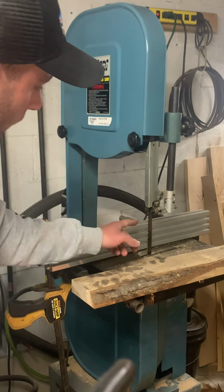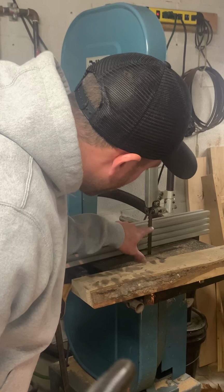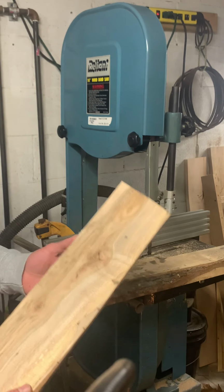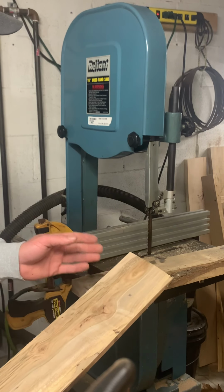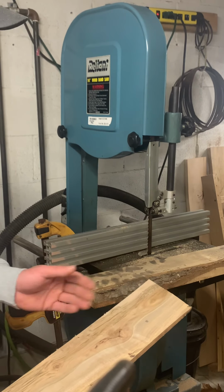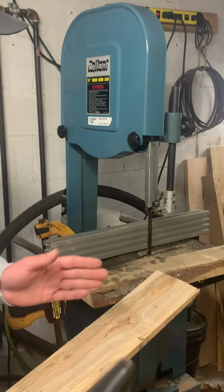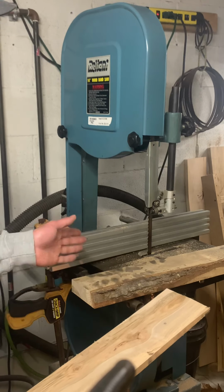And I have to say, I forgot what type of blade that is. It's got like a brown mark going through it. I believe it was like 50 or 60 bucks, but it cuts beautifully. And it doesn't lose track because it's a 3/4 inch blade. I've tried it with 1/2 inch. Yes, they do resaw a little quicker, but I feel like you really have to crank them down to make it hold the tension, at least on this saw.